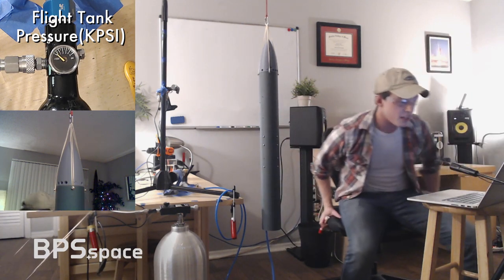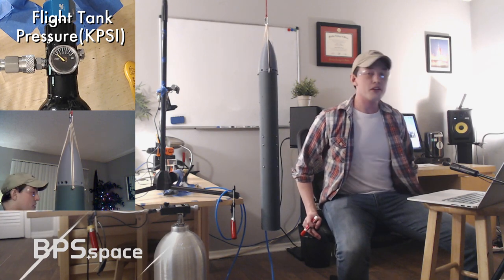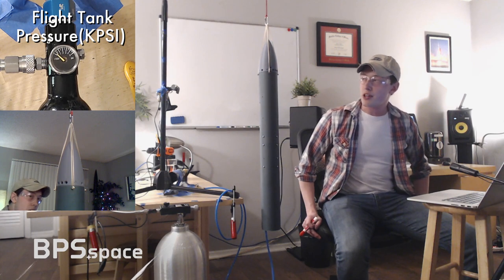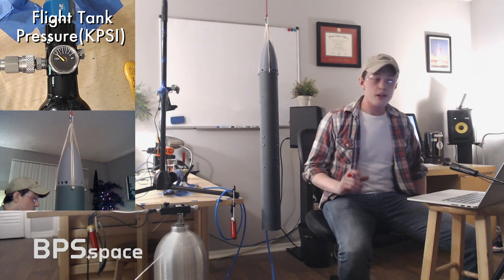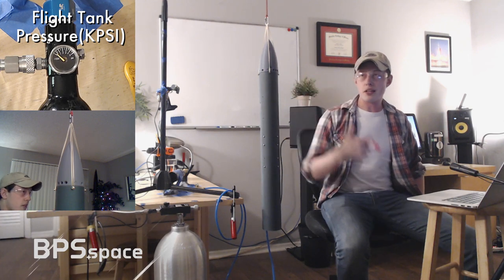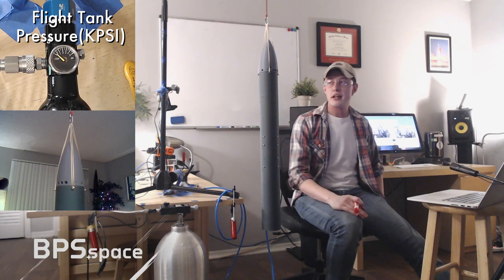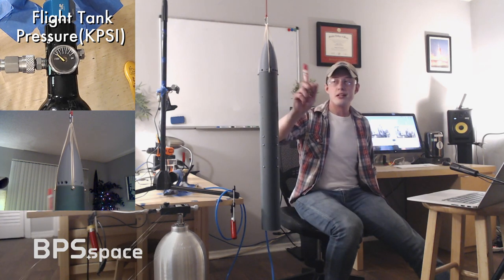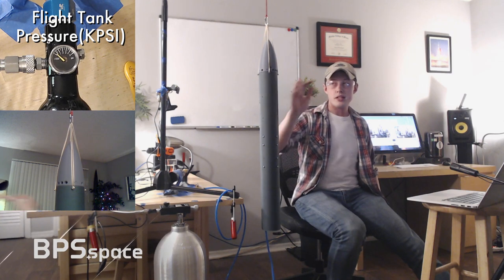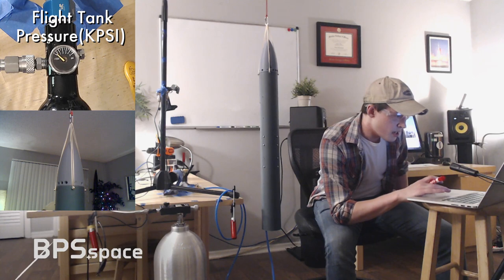Also, Douglas Scott, thank you for the super chat. He says, how about thrust ports not quite so close to the center? Douglas, that is exactly my thought as well. I thought the roll thrust was going to be a lot higher, and that I'd have an easier time controlling the vehicle than I do right now. So these are actually in a suboptimal place. I'll have to put these thrusters slightly further out from the CM, and that'll give us a lot more torque along the roll axis.